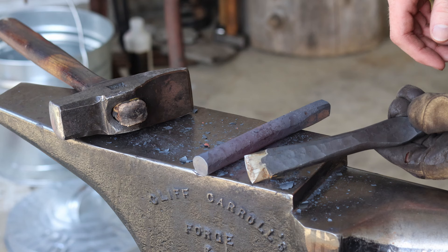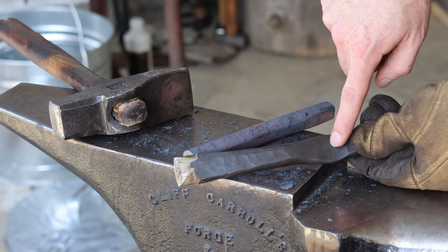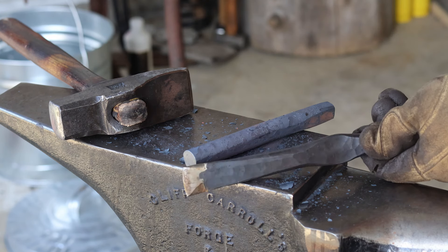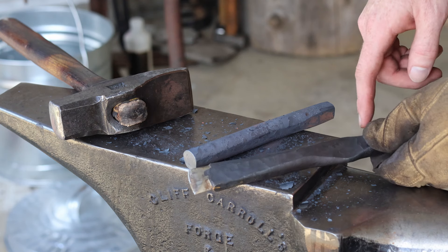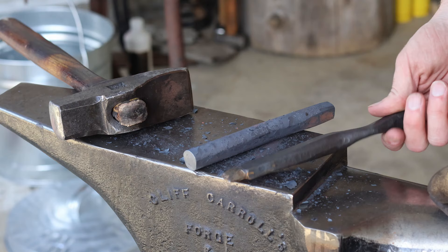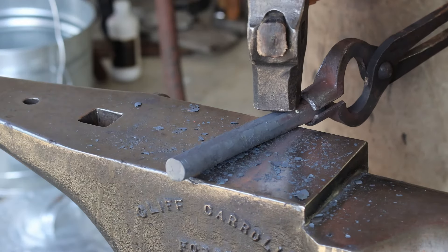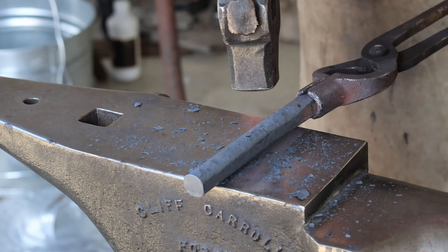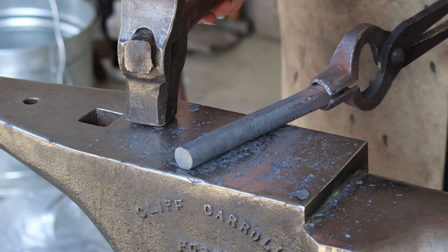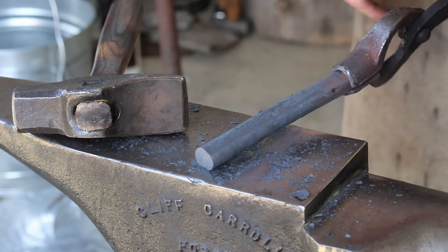My main goal here is to forge very similar to this chisel, with the exception of not doing this kind of thumb swell here. I really like this style of punch and chisel; however, it is Mark Asprey's signature style, and as such, I feel like I need to kind of branch out and establish my own style of chisel. I'm going to do just one more heat where I blend all that flat into each of these sides of the taper back here for the struck end, and then move on to spreading the tip of the chisel and blending that all together to make it look real nice.